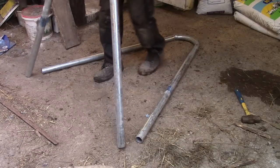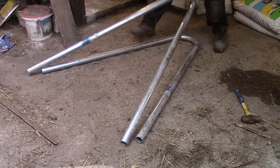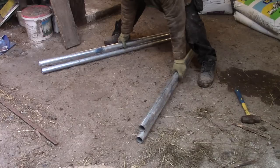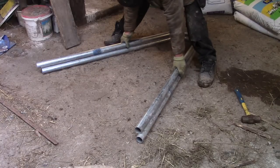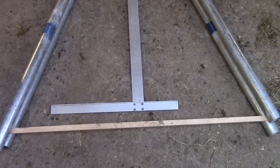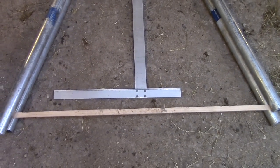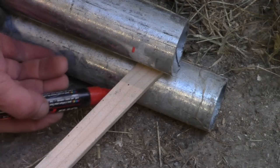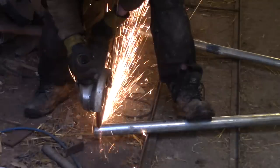And they cost about 35 euro each. So I needed to lift the log clear of the ground. So I adapted the arch I'd made out of galvanised pipe. My pipe bender won't bend very acute angles so I just had to bodge the last part so the bend would be tight enough and the arch would be upright enough.